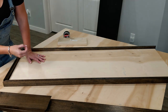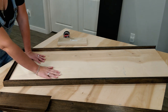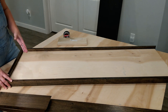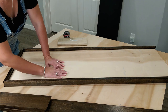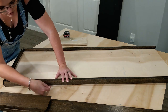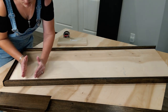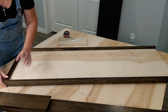One other thing to pay attention to if you're building the door: whichever side is your hinge side, when you're drilling in your framework make sure you're not just spacing screws every two inches without leaving room for the hinges. We spaced our pocket holes so we knew exactly where the three hinges would go. Make sure you're leaving room for your hinges when drilling pocket holes as well.